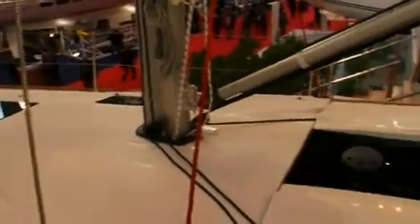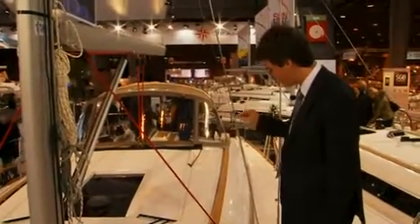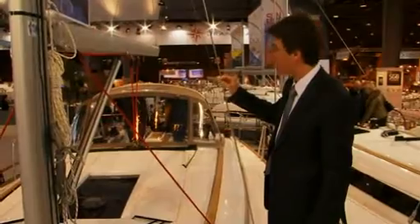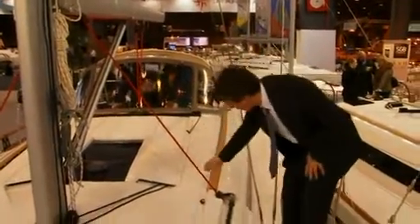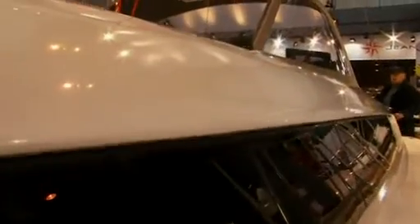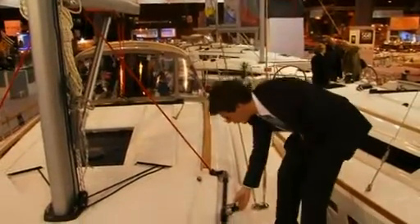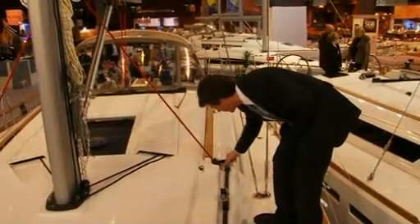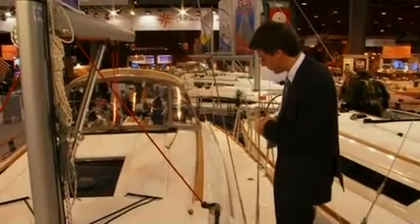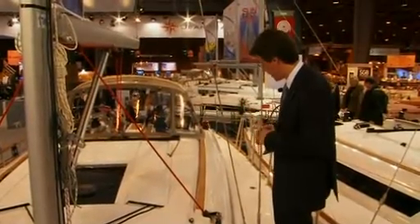Another thing that we really wanted was to have very clean deck lines on the boat. Obviously the design is seen from far away as a very classic, very stylish boat, but when you get closer in terms of the details, we wanted the lines to be very clean. You can see here the main sheet coming down off the boom from the large traveler track, coming through a block and led down underneath what we call the eyebrows over the windows — which are a separate part — all the way back to the helm winches. Same with the Genoa system: the Genoa car comes down, and that sheet is led through the bullet block and then back all the way to the winches at the helm. So everything comes back to the helm in a way that is very discreet and very well integrated into the deck.